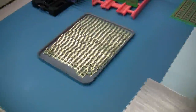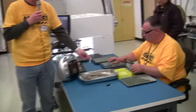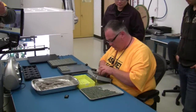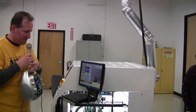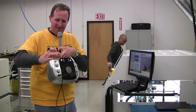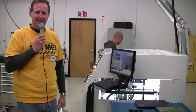Then we run over to the legging jig, which is being done over here. We take these header pins — now the boards are separate — and load them into a strip long enough for three Basic Stamps in a row. We stick them in the jig and pinch them onto the PCBs. They have little flanges perfectly sized for our PCBs, so they hold on through static tension. After that, we dip each side of the three-up stamps into a molten solder bath, the legs are soldered on, we trim the tab off the bottom, and now they're separate and ready for testing and bagging.